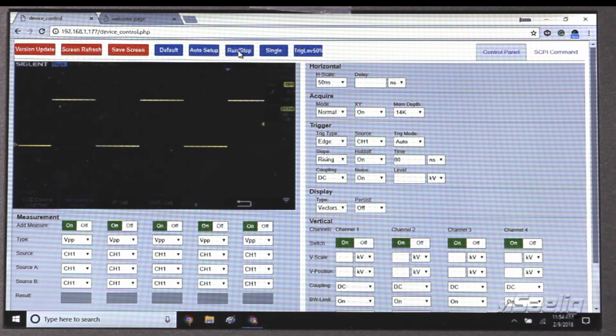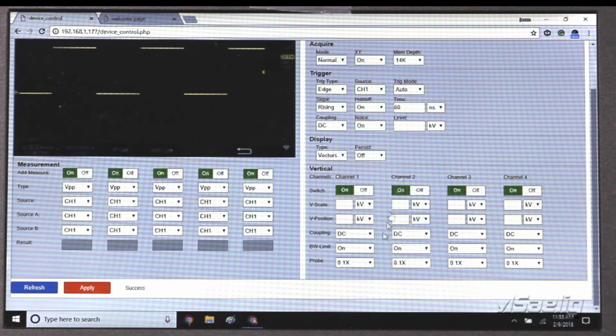You can stop and run the scope, single trigger, also set the trigger levels. You can also update the oscilloscope itself with a new firmware revision remotely. Here you'll see we have horizontal controls, acquisition controls, as well as all of the triggers, and each of our channels are located down here, so we can enable or disable channels as well as measurements. And I'll scroll down. We can refresh and apply any of those new settings, so we can reconfigure the oscilloscope from a distance, apply those settings, and the oscilloscope will then reconfigure to those settings. So we have full control over the oscilloscope.